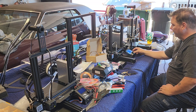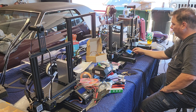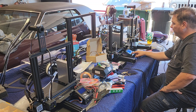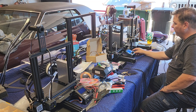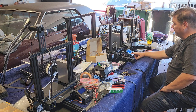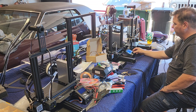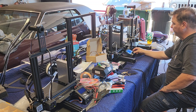Now it's homed. I'd like to do a preheat. Let's go to Temperature — nozzle and bed. Let's go to Preheat PLA config. Fan speed is 100%, nozzle temperature is 200, bed is 60. Going back — I just want to preheat.